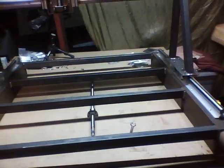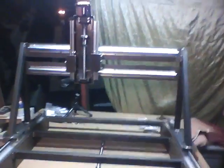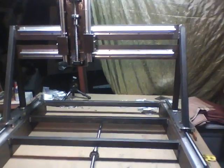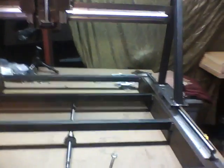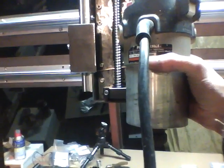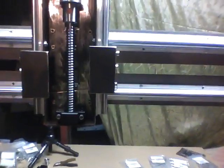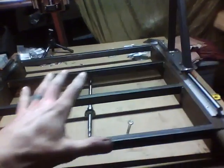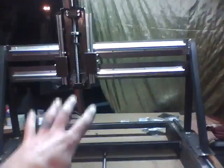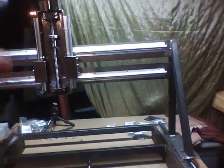I still think that my Z-axis — the whole gantry — is tall, it's too high. But I've measured it over and over today, and it is right. You figure in the router is about there — the router is going to hang down a little bit, then there's the collet of the router sticking down, plus a little bit of shank of the bit, and then another inch and a half coming up of deck. So the bottom line is I've got my full eight and a half, almost nine inches — eight and three-quarters, something like that — of total travel on Z.